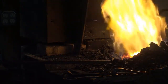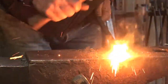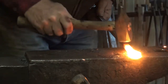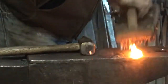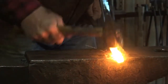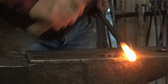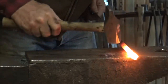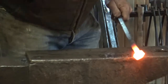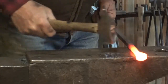The material will also start to disappear down into the fire — it'll start to be the same color. Then quick, light blows — try not to collapse your eye. As it starts to cool I'm going to start creating a shoulder just off the edge of the anvil for the transition from the spike to the ring for the pintle. In this case I'm actually not going to go for a spiked pintle — the customer's request is for one that is threaded and will have a nut on the backside. A spike is quite simple: you just draw that end out to a spike after you've got the pin welded in.